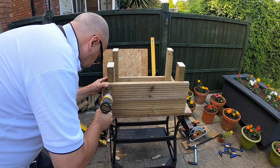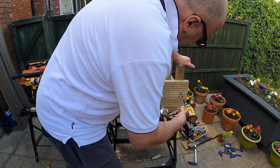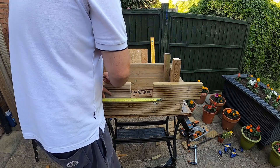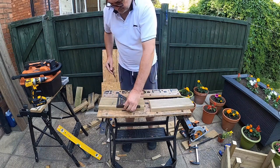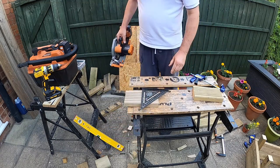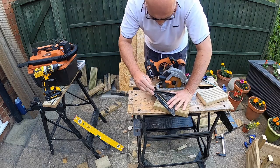Here I'm starting the second layer - the walls will be two boards high. I'm going to leave the front of the shelter until last because I'm going to need to cut it to size in order to make an opening. I decided to make it about five inches wide, which would be more than adequate. I'm also going to cut away the corners of the opening just to make sure it's not sharp and doesn't catch the cats when they're leaping in and out - and the extra design feature will hopefully add a bit of extra curb appeal.